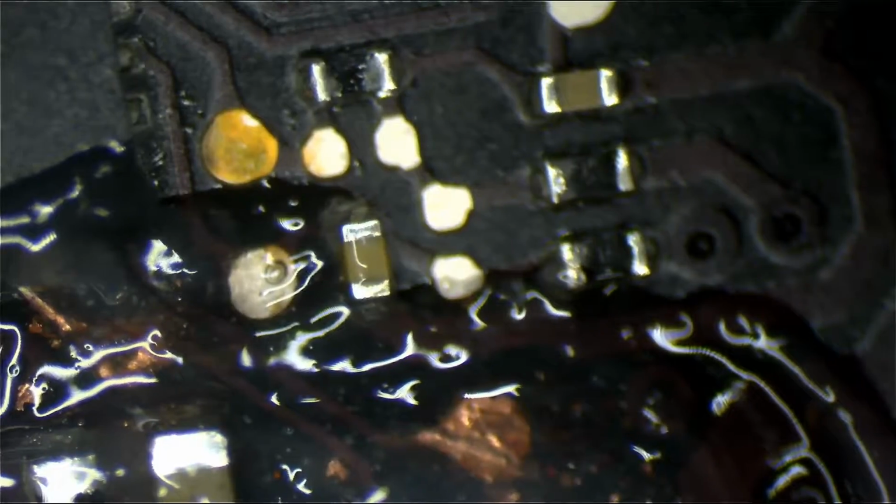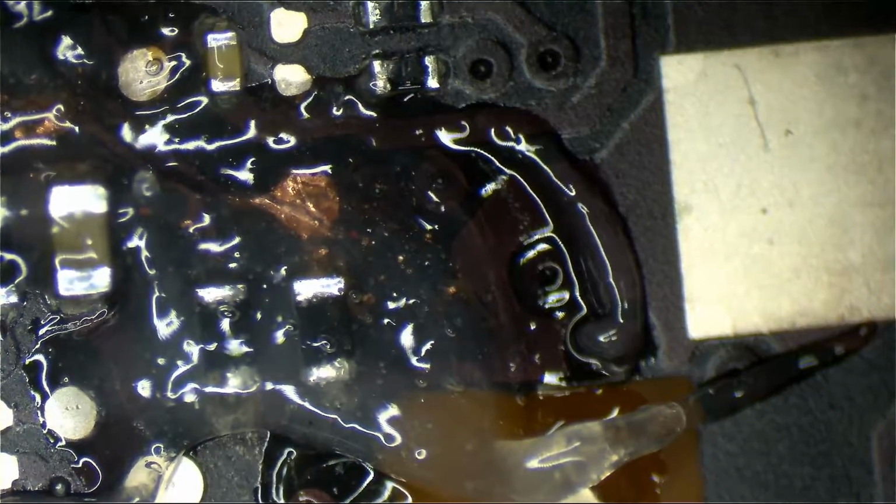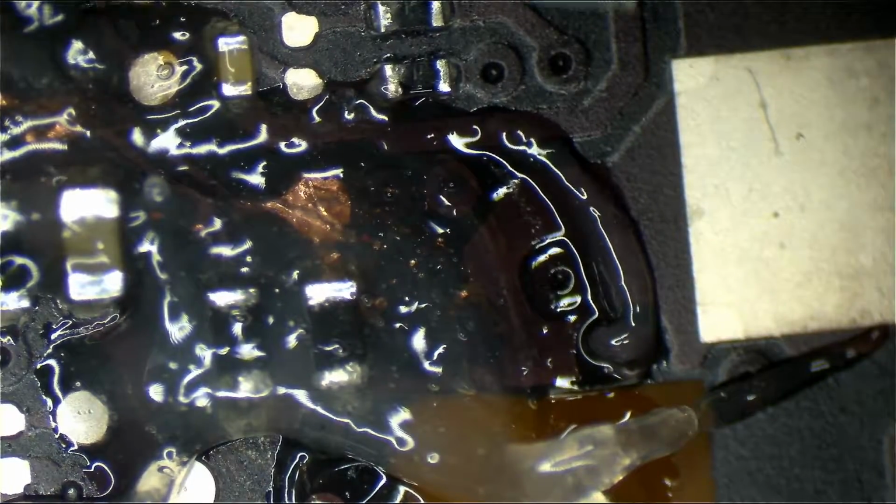The way a buck converter works, very simply, is it's going to take a higher voltage and turn it into a lower voltage. So this computer has a 12-volt battery. However, it has a CPU that runs off of 1 volt. If we send 12 volts to the CPU, very bad things will happen. The CPU is not going to be happy with that. So we have to send it 1 volt. So how do you turn 12 volts into 1 volt? Well, what we do here is we switch. Go back and forth, switching, switching, switching.